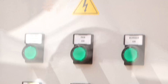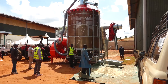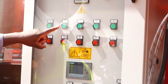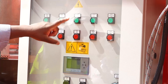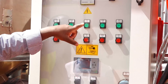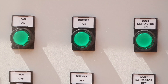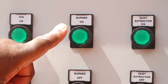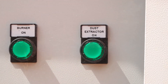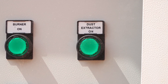After we switch on and set the settings, the first thing we do is start the central auger — the one that goes up — so that one starts running. Then we start the filling auger, which brings the grain in. Once we do that, we turn on the fan to pull the air from the burner into that basket. After the basket is full, or at least 80% full, we start the burner. The flames come from here and shoot down. At the same time, we can start the dust extractor, which blows the dust out and exits into the environment or to a collection point.